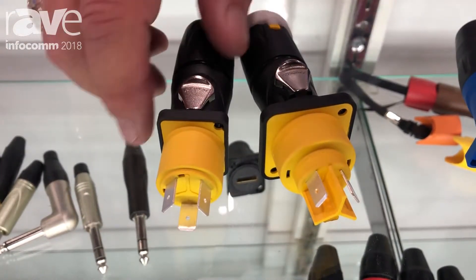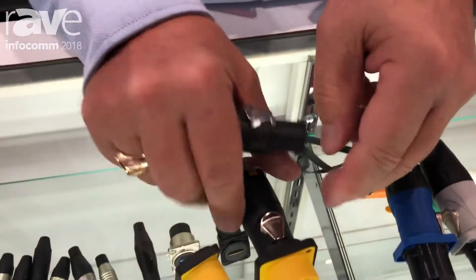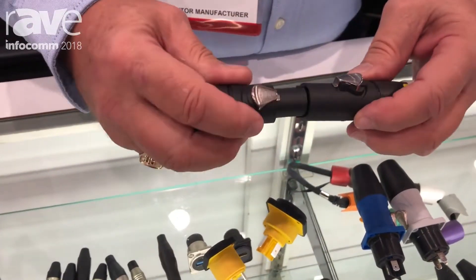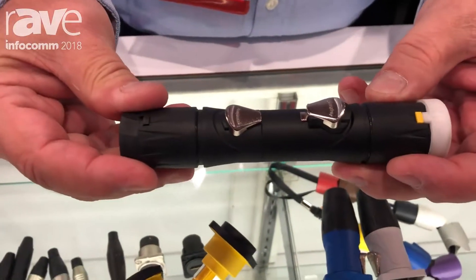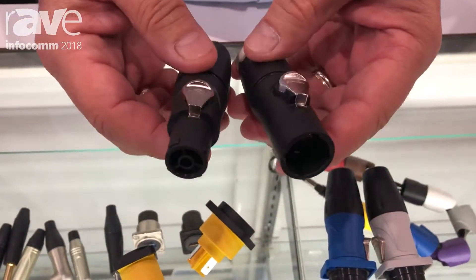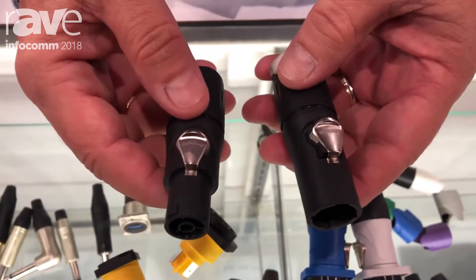The beauty of this product line is that, unlike the HP Series, you can make cable ends to cable ends without any kind of an adapter, which makes it nice for making extension cords. It's also IP65, which means it's hose-directed watertight, so it can be used in outdoor applications.